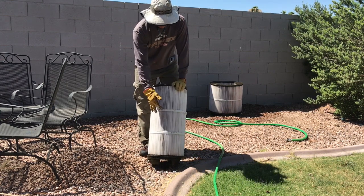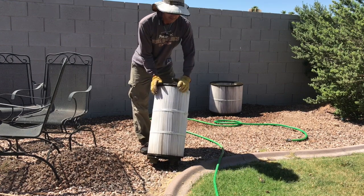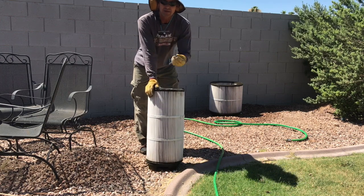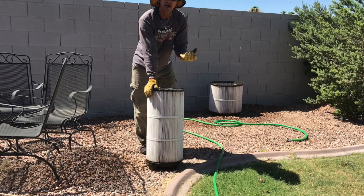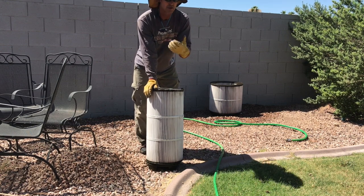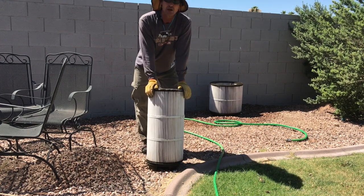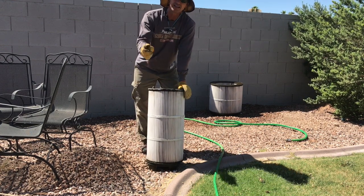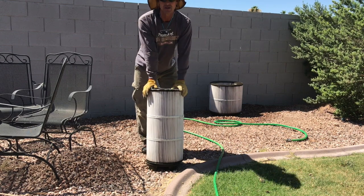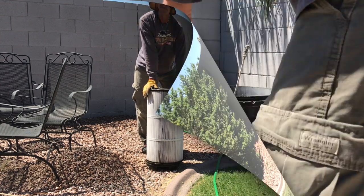The other thing though is, even with the bands, I've seen the bands break within the first year or two and the cartridge is fine. You really want to inspect the cartridge and just look at the fabric. If it looks pulpy, and again, look at what it looks like when you first got them, you can see the very fabric, it looks like fabric, right? But then as time goes on, as years go by, you'll see this start to get more and more pulpy, and that helps you too. But again, I'll do a full video on the things to look for to tell you when it's time to change those cartridges and get new ones. But let's go back to the filter and let's clean it out, lubricate it, and put it back together.